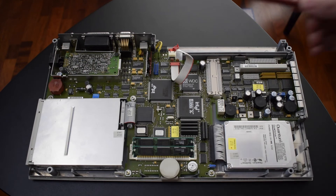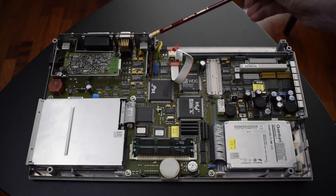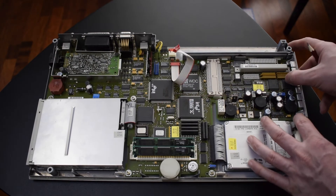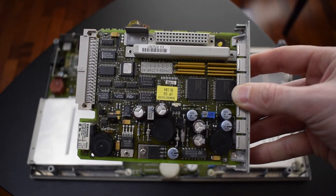Standard 1.44MB 3.5-inch floppy drive with a funny notebook connector. The hard drive is an 80MB Quantum — I have created an image with Norton Ghost just to stay safe in case of drive failure. This here is the lid open/close switch and next to it the LCD panel cable. The proprietary Siemens interface can be removed; it slides in and out and is secured by a screw.